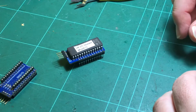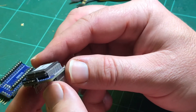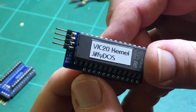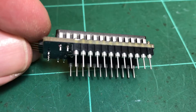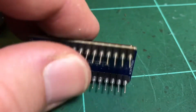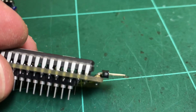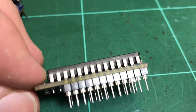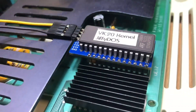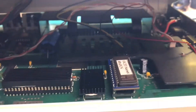So that's it. I've already got the switch in my VIC. I'll take the old one out and hopefully this one should now fit. I'll take the camera off the tripod — wow, you can actually see now! So that's all ready to go. You can see the solder's come through on the top as well, just for a bit more mechanical strength. And this actually just fits above the rectifier heat sink. Let me get it all set up in the VIC and show you. New one's in. Much better — that fits. Perfect.